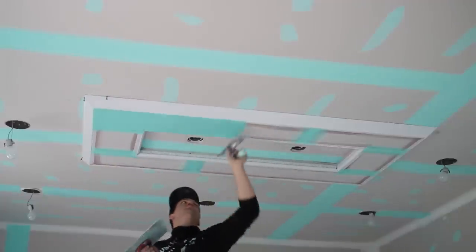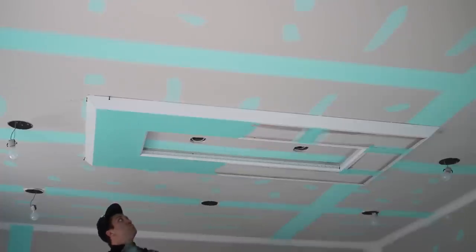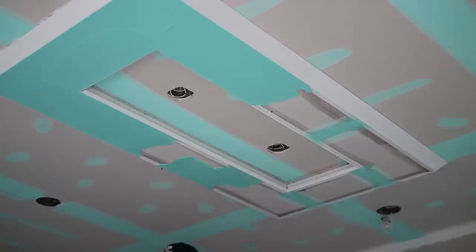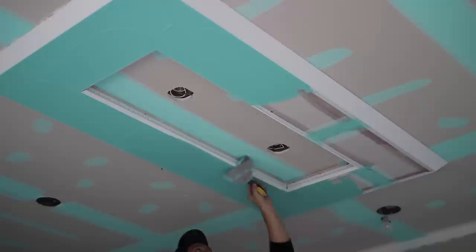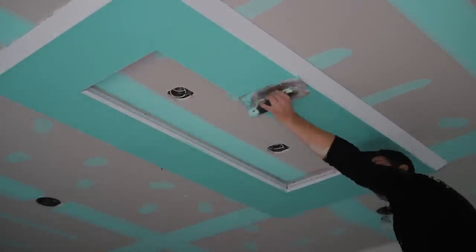As a tip: while mudding, you can use screws in the corners of your outside miters temporarily to wedge the miters closer together until the caulking dries, ensuring a nice tight miter. If you have a wavy or uneven ceiling, the screws also help the beads stay tight to the ceiling. The tiny screw holes get covered up when you caulk the outside edge of the Easy Tray. Alternatively, painters tape works excellent for holding miters tightly together until the caulking dries as well.